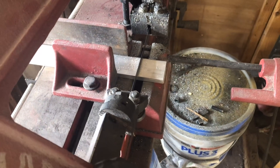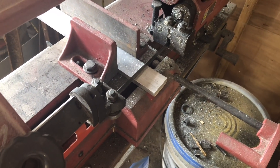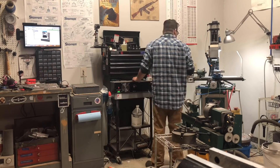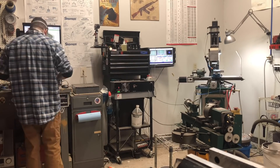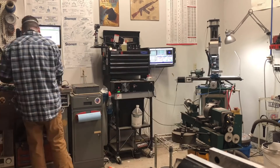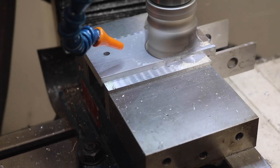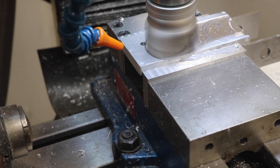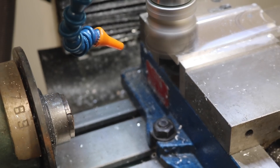I need you to see the bandsaw cutting off the stock from the bar on this aluminum, because the bandsaw is always competing for the shop vac for employee of the month in my shop. If you haven't seen my channel before, I have a small home-converted CNC milling machine, a Grizzly G0704. I converted it myself. I use Fusion 360 for CAD and CAM, and I just have a little shop in my backyard — a detached two-car garage. I'm cutting down this piece of aluminum to make a disposable pallet from some scrap in the shop. I'm smoothing out the top and leaving a ledge on the back. For this first operation we're going to use the supergluing tape work-holding method.